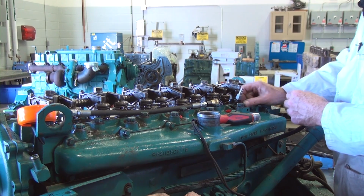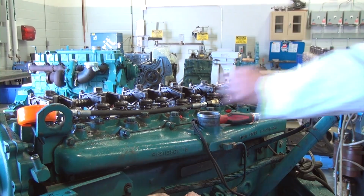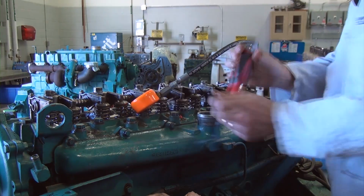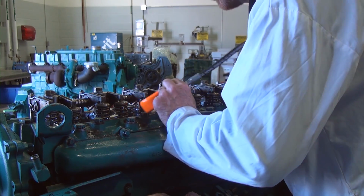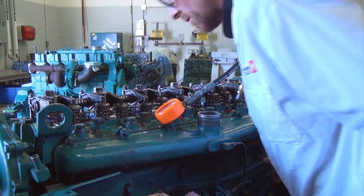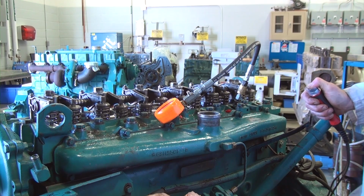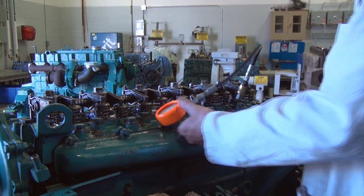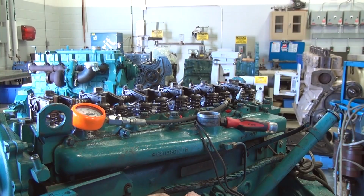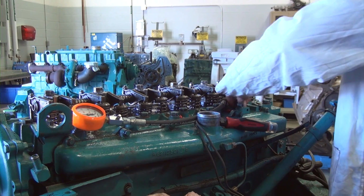So number 5 now, we are going to do our first stroke and then our build up for more information on our diagnosis. So continuing on with the process, removing the pressure from the gauge. First stroke, number 5 cylinder. 225. Build up, number 5. 375 for build up on number 5. Number 6 cylinder, moving right along. Number 5 so far seems to be the one that has the lowest build up pressure of 375.